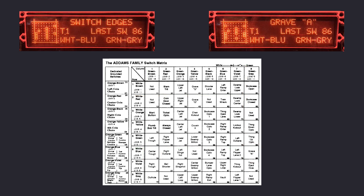The way to troubleshoot similar ghost switch hit problems is the following. You start off on the column of the switch that is incorrectly registering. Then look for other switches closed on that column. Then look for other switches closed on the row of the ghost switch. Your suspects are the switches in the crossfire of these. The switch with the bad diode situation is always the diagonal one from the ghost, but the switch appearing to trigger the ghost may be either one of the three.